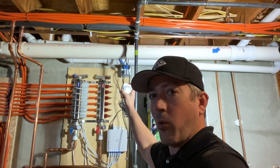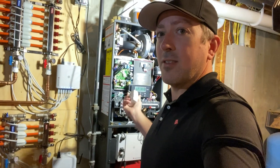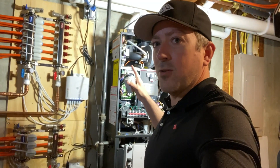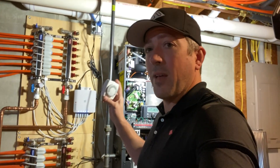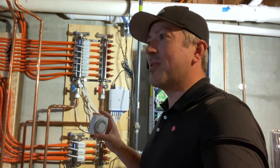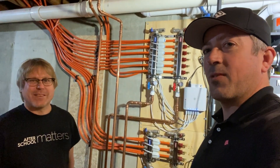What we tell people is to get a little mechanical timer — like a Christmas light timer. You plug that in, plug your boiler into that, and it turns on and off. Every time the boiler loses power it shuts down, and when it gains power the algorithm knows to kick on and start sending hot water to all the loops. It's very rudimentary but a good method during construction. Now Michael's going to get to enjoy all his zones kept within a one-degree temperature span. Thank you so much, Michael. Thank you, Russ — have a great day.